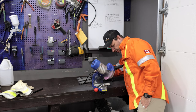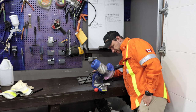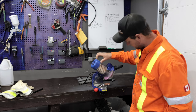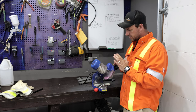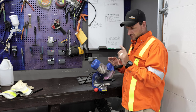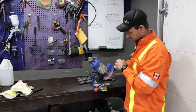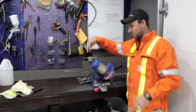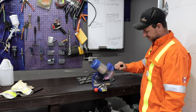Here's the chainsaw sharpener — it's a bench-mounted electric chainsaw sharpener, 2.1 amps, 3,500 RPM. I don't have a model number, but there are different ones at Princess Auto and Harbor Freight — there's also a really small version. It comes with three different blades; I picked the middle blade because it seemed to sit in the groove of the tooth the best. I mounted it to the table using just two deck screws — screwed it in and it's plenty safe.